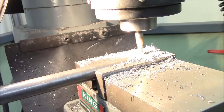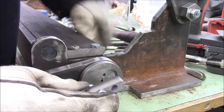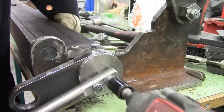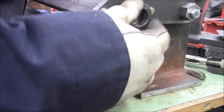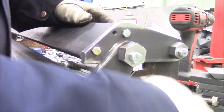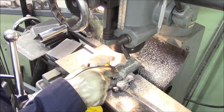I milled some flats onto the sides of the handle so they'd stay nice and secured onto the eccentrics. Five-sixteenths bolts in here — rattle it on in, and it's loose and sloppy enough that everything moves gorgeous. And then got the eccentric up at the top as well, with a three-eighths bolt — I think I welded a nut on the backside just to make it a bit easier.